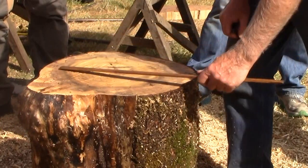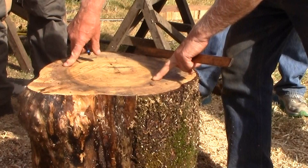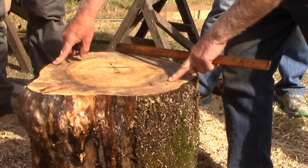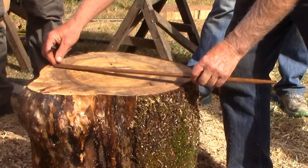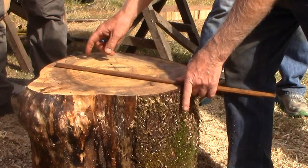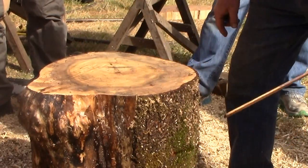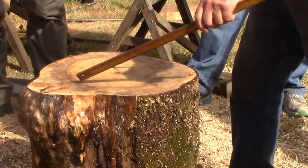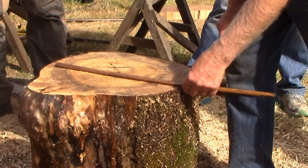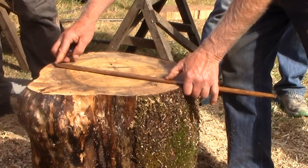All right. So here's the question: how wide? If you want just heartwood, there's how long you need to cut it. You want to leave a little bit of sapwood, which I would in this case. I think that's some of the prettiest bowl area. But you can see this is gray, dirty. I can tell you when this is dry, that won't be pretty. But that's life. Let's say we got 13 inches here, all right?